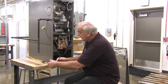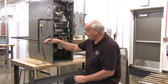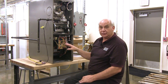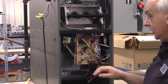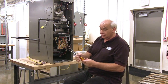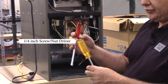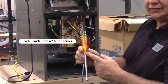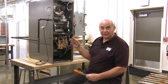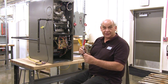First thing I'm going to do is unhook the 120 volts of electricity going to the furnace, because once I get into this compartment there would be a lot of live electrical connections and we want to make it safe to work in here. The two tools I'm going to use are called nut drivers. One is a red-handled nut driver and it is a quarter-inch. The yellow handle is a 5/16ths and it fits a 5/16ths screw. On all furnaces and air conditioners, all the screws are either quarter-inch or 5/16ths.